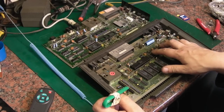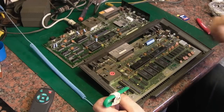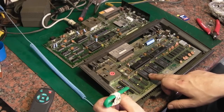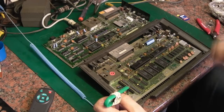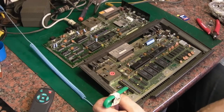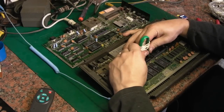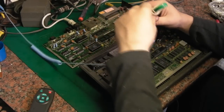It allows you to use one of them, but you'll lose the ability to control the tape drive motor from the Plus4. It also involves, I think, changing one of the ROMs. I think it's the kernel ROM that he's basically hacked. He must be a clever chap. He's basically hacked the kernel ROM to allow it to address this alternative CPU. Apparently, apart from the motor issue, it works fine. So that's at least one hope, because I do have more TEDs than I do have CPUs, and like I said, with a modern SD card solution, it wouldn't be a huge issue, I don't think. And it would mean a working computer rather than a not working computer. So that's something I'm possibly going to look into.